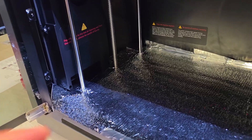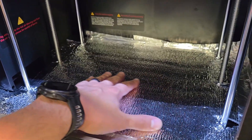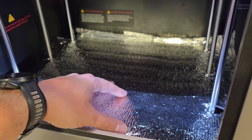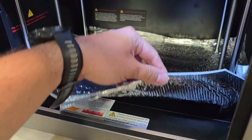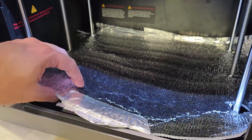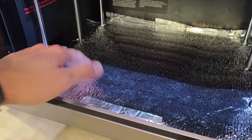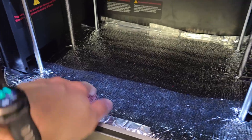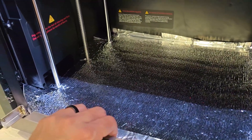One final note about the Plus 4 heater is it blows directly onto the bottom panel, which is sheet metal. This panel got around 80 degrees Celsius. The power supply is also mounted under it, which seems like an oversight in my opinion. Adding insulation reduced the temps on the panel to around 50 degrees Celsius, which also improved the heating performance of the chamber. Overall, I think the heating performance on the Plus 4 is excellent, even better than the Q1 given its larger size.